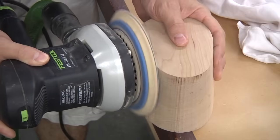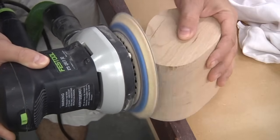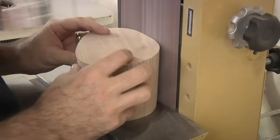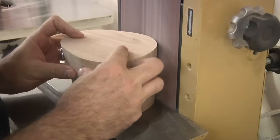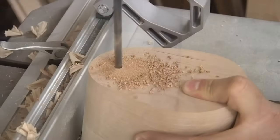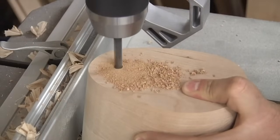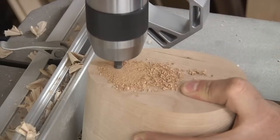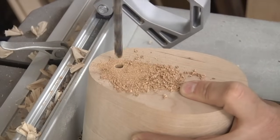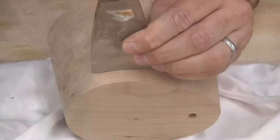The bandsaw can leave a rough cut, so use a sander to clean up the marks and refine the shape. Since I'm making 4 of these, I'm pretty thankful for my stationary belt sander, which makes quick work of the sanding. Now we need to drill a hole for the bolt and a starter hole for the insert. We'll do it all in one shot using a 1/4 inch bit. The bit only goes about 3/4 of an inch into the bottom piece.